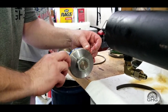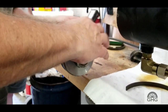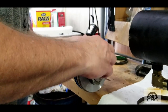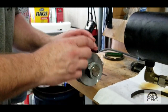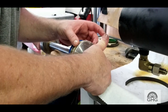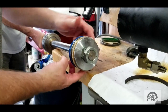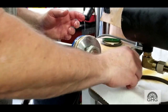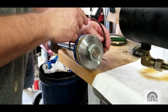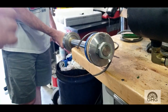It's called lube — a lot of lube. Now this is a felt wiper — it keeps the cylinder clean as it extends. As this thing extends into the cylinder, it keeps any kind of junk out of the sealing surface of the seal. That's what you're after — keeping it without any more damage, because that's what's holding the pressure. This is just a Teflon guide — it doesn't do anything structural, just guides.